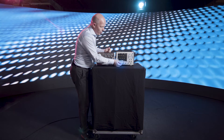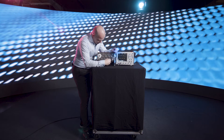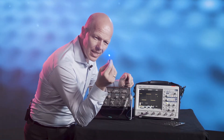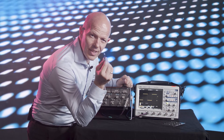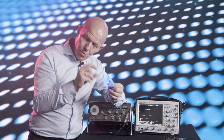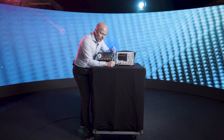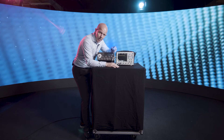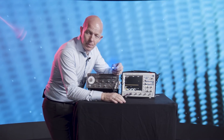What we need to do is control the intensity of the LED. I have here a blue LED and I will now switch it to a very low frequency so that you can see that it's blinking. You'll notice that about half the time it's off and the other half of the time it's on. This is called the duty cycle. Basically half of the time it's using current and the other half it's not consuming any power. And the important thing to notice is that when it's on, it's fully on — there's no resistor in connection with the LED. So there's no waste of energy; all the electricity is going into the LED and being converted to light.